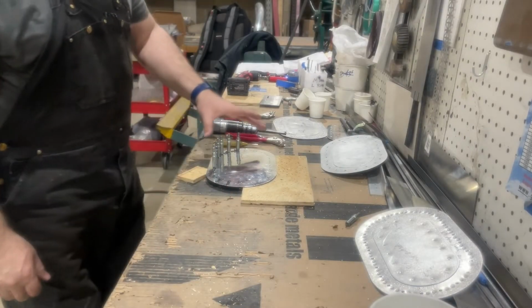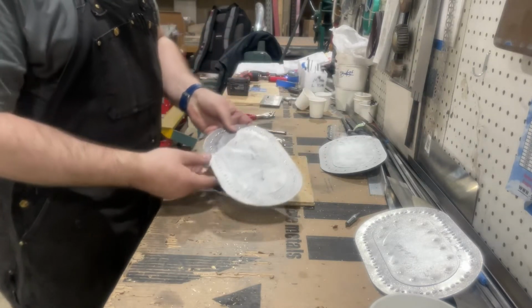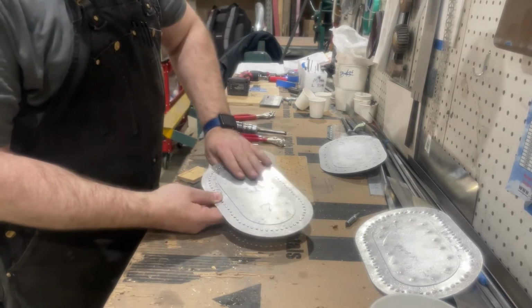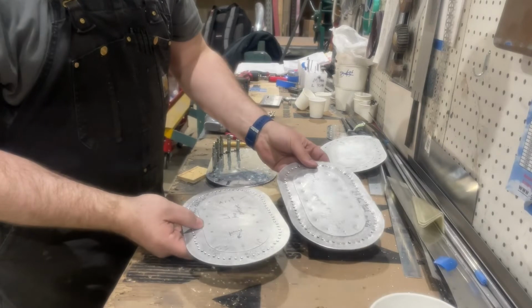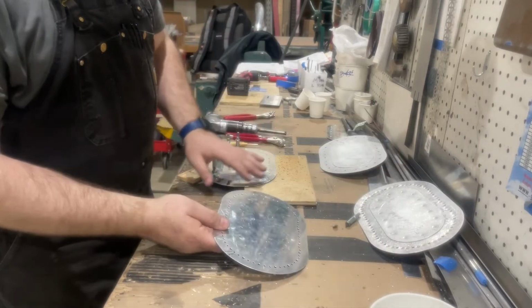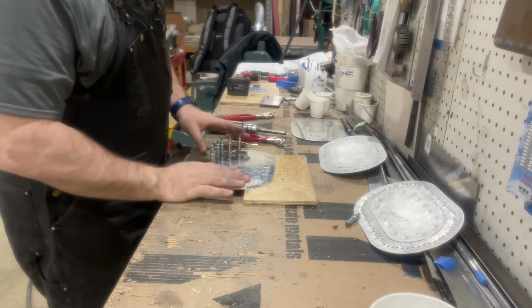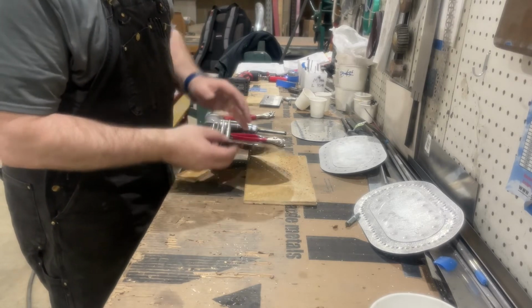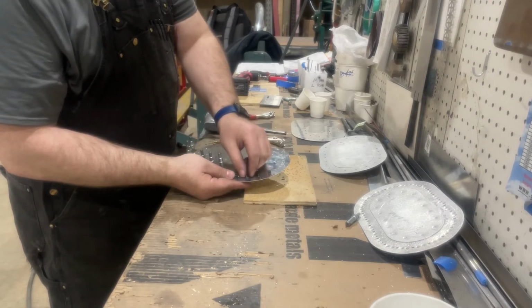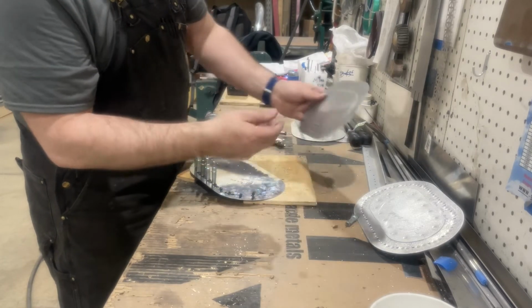Working on the inspection covers for the auxiliary fuel tanks. Owen got this one done. It's all riveted with flush rivets, solid flush rivets, and looks a lot better than the one that was dimpled. And there's no distortion to it. It looks really good. So finishing up the replacement one for that one right there before we do the nut plates. And so I'm getting the nut plates ready. So the nut plates allow a bolt to go through, and then the nut plates get riveted in place. So they stay on the back side so you can screw them in.